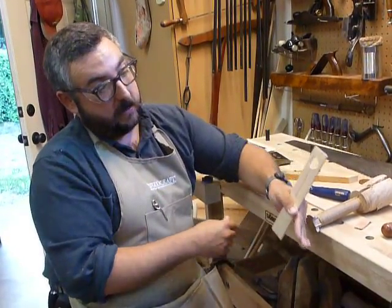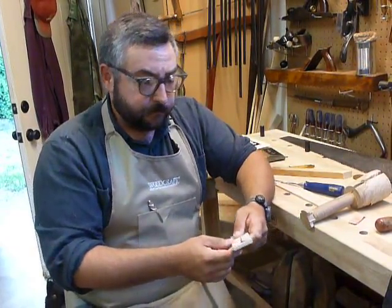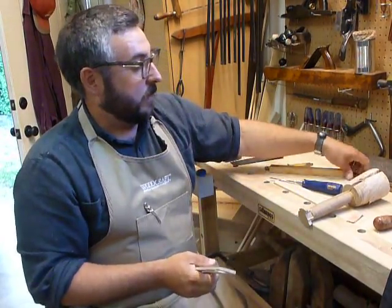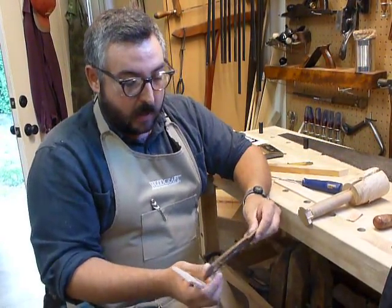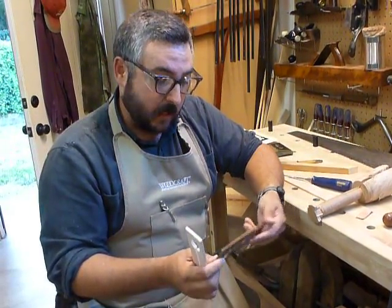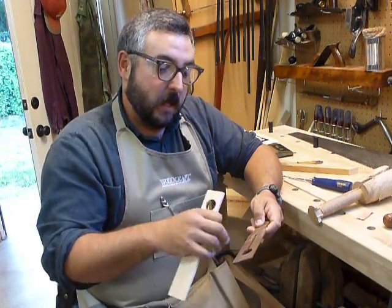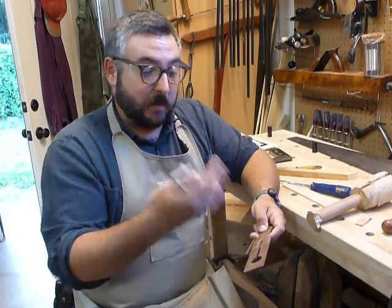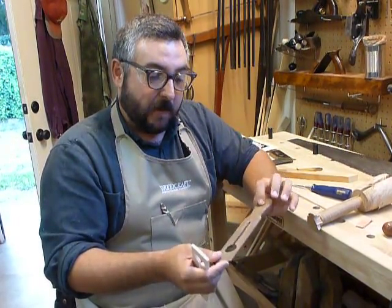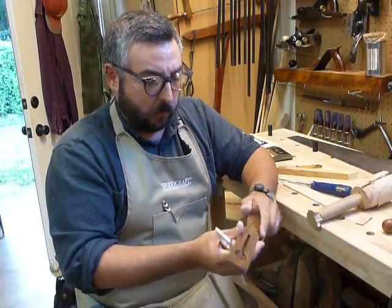I mean, you could even cut it down so it's even shorter if you wanted to, fit well in your pack. The one thing you definitely want to do is you want to coat it with something. These ones that I made for our company, I put some stain on it and 2 or 3 coats of shellac. And the whole idea with treating the wood is that the metal polish that you use doesn't build up in the wood and you get a lot more life out of your button polishing board with a little bit of care or treatment of the wood.